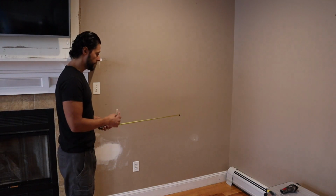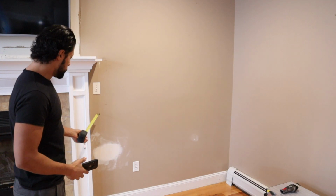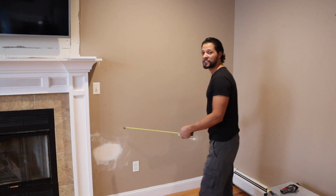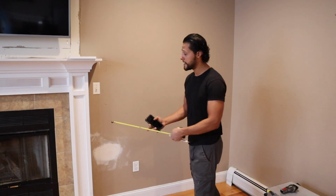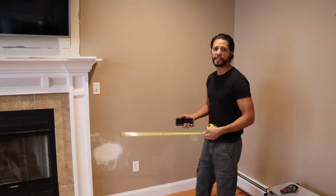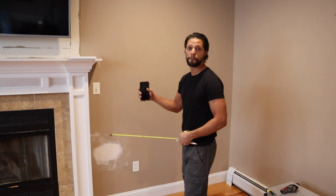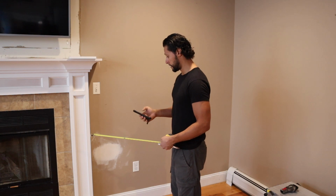So the simple math here is, now the rule of thumb usually between the boxes is anywhere between 3 and 4 inches. In a small space like this, I could go 3.5, but I'm going to first try 3-inch spaces between each one of the boxes. And I'm going to see if that gives me a nice, even, roundabout number. And if it does, then I'm going to use that measurement and I'm going to make a spacer block. Okay, so let's get the calculator out here.